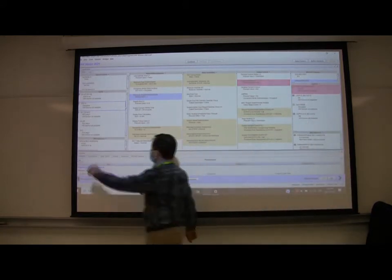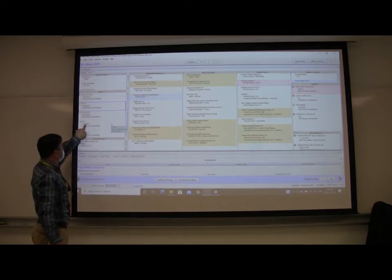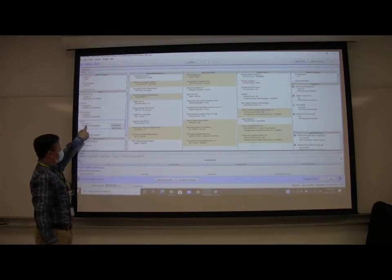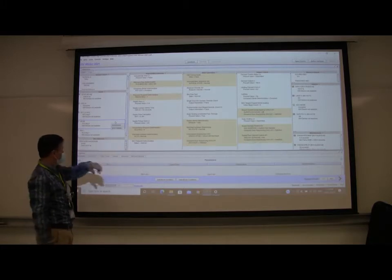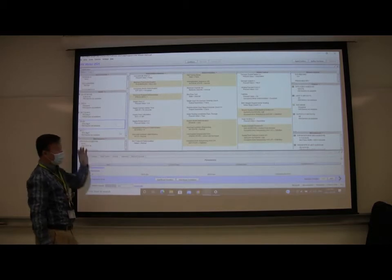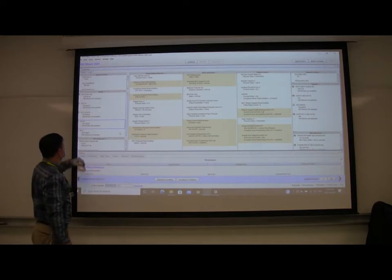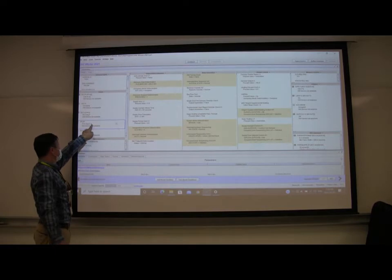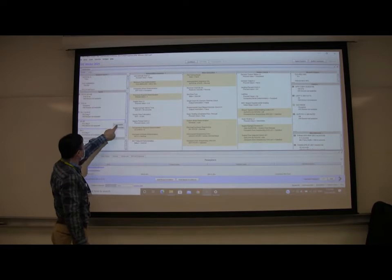And let's see here, like the set point here. The set point here, and then command. We change this value. We set the temperature higher. The set point is higher than the room temperature. Then the heating should start. So we change this one. Let's say 80. 80. Yeah, here.